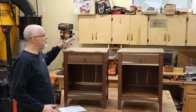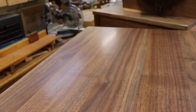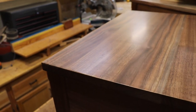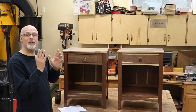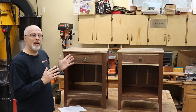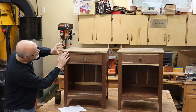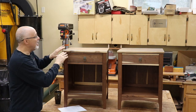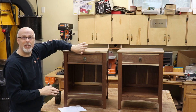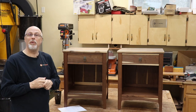Finally, the top — just some glued-up walnut planks attached from the bottom with expansion and contraction holes that the screws are fastened through. I elongated those with the drill before attaching it. There are also some nice subtle details down below with a little chamfer and an OG on the bottom — a nice little detail I followed from the plan itself.